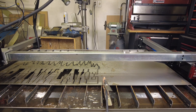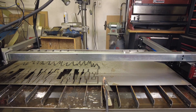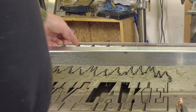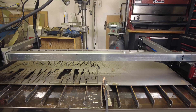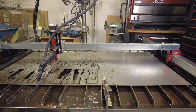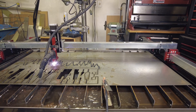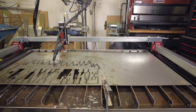We still have one little problem where we lost our voltage in here. We've still got a little spot there that didn't cut. So what I'm going to try doing - I've reset and selected the line number that should start us down in around there, and we'll recut that and then stop. Hopefully it'll cut through this tab and then the rest of the sign should just pop right out of that piece of steel. We generate new G-code from the spot where we are and hit start.